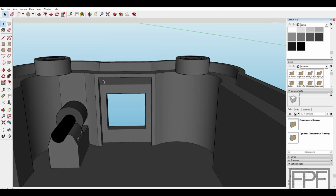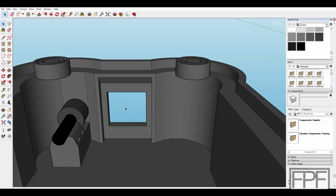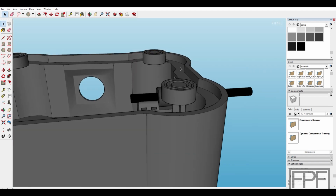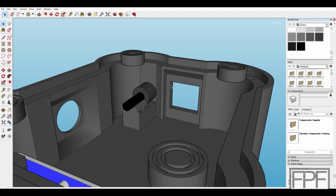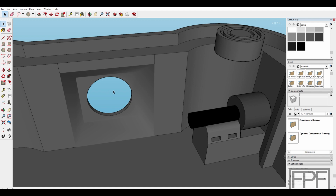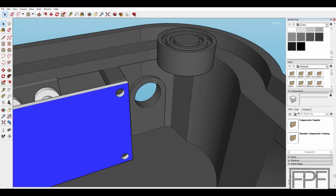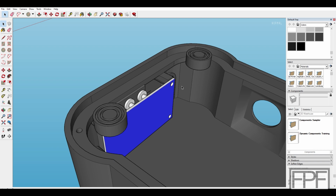Okay, so I got rid of the hole up here that was the wrong dimension for the cable gland, beveled this out, and moved the square hole for our power outlet up to be centered in this space. It's not going to be centered on the rear, because we lose all this real estate up here to that shelf for the bottom cover to fit on, but we have plenty of room now for that here. I brought these sides over so that we have room for the switch to click into place. I also made the diameter of this hole slightly larger, and I did the same thing for this one as well. That momentary switch was a real tight fit in here. This switch over here fit okay, but it seemed like I wasn't going to be able to push it all the way in to lock it in place without a little bit more room.